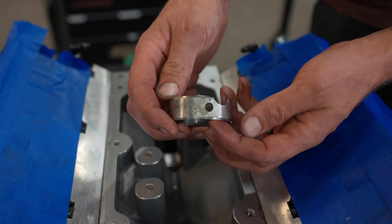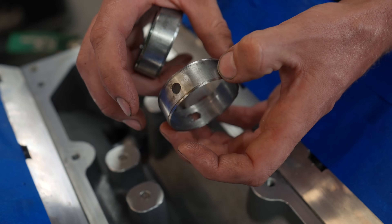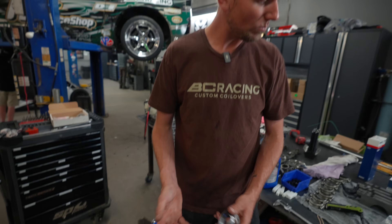That's actually the bearing that was in it — that's one of them and there's the other one. What would actually happen is these had spun and then started to walk in. Why didn't this happen last year at Driftmasters? Well, at Driftmasters you practice, qualify, and do competition immediately — all super quick. We're doing DMCC, which has a full day of practice, like eight hours, plus a full day of competition with practice again. So these three events on this engine have had probably more seat time than all of Driftmasters the whole year. So this was going to happen when we were in Europe — glad it happened here instead.